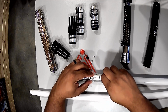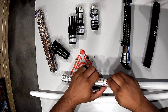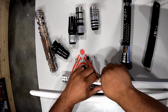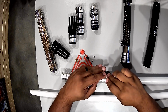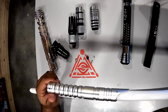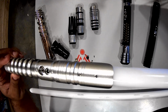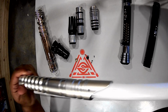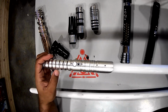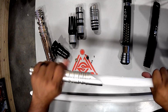And then you flip your wrench over, use the short side, and we'll go back and put another turn or two on each one. And there you go. Now you got your 3 retention screws in. Trying to get it close up there. 1, 2, 3. So you got your 3 retention screws in now. It holds pretty tight. It's not going to come out.